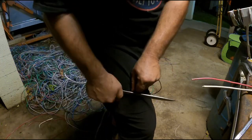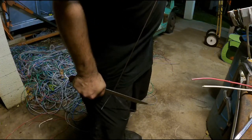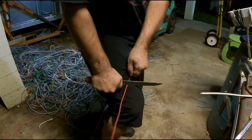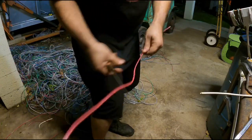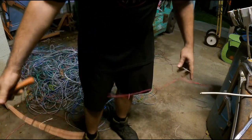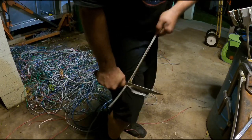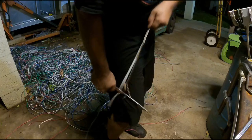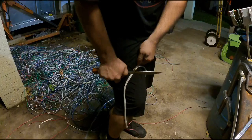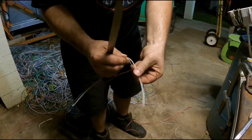For really tiny stranded wire, a razor blade digs right into it — comes right off like butter. Solid core, same thing — bend and twist, comes right off like butter. For the romex, strip it down — keep flaying, get both sides, and it comes right off. Keep stripping it and it comes right off of there.